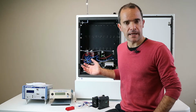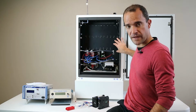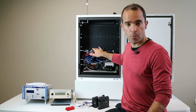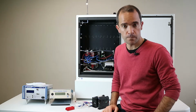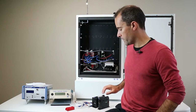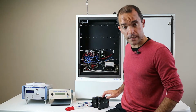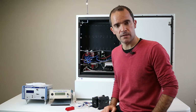So in this particular case, this AQM65 has a long form factor NO2, which we need to replace. It has a CO module and it has an SO2 module. It does not have an ozone module. So in this example, we'll be needing to remove the NO2 module and replace it with the OX module and the ozone module combined. So that means that we actually need to add one additional module into the gas stream.